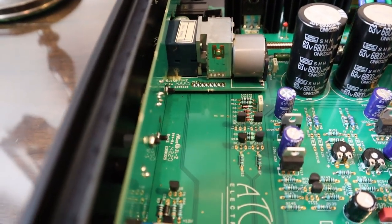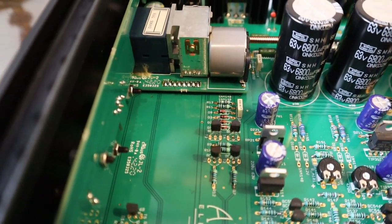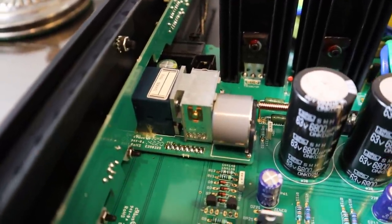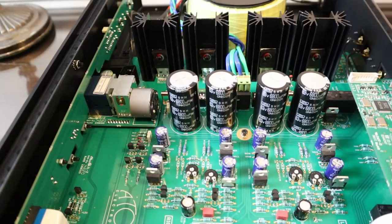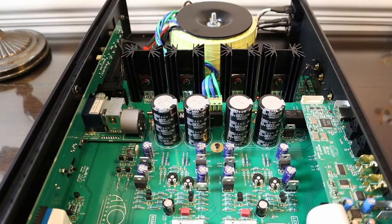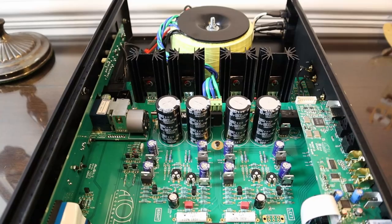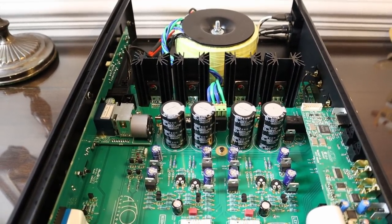There's not much of a preamp that I can see. There are four little transistors here which could be part of the preamp section, so there might be a little bit of gain here. And then you have the ALPS motorised volume control — it's an analogue volume control, decent quality part. So it's possible that this could have a passive preamp section, which is the case with the Exposure 2510. You can get away with that with amplifiers with modest power. This is rated at 80 watts into 8 ohms and 120 watts into 4 ohms, and it's got plenty of open-loop gain to play with, so a passive preamp is possible.